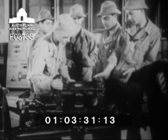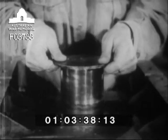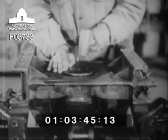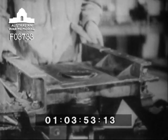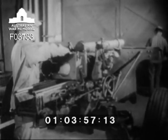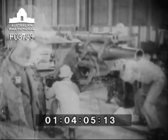The top carriage rests on the support, to which it is connected by a pintle. This top carriage swings right and left on the support, pivoting on the pintle. With the support level, the top carriage, which rests on the support, will of course also be level. This means that the howitzer itself is cross-leveled and ready for action.